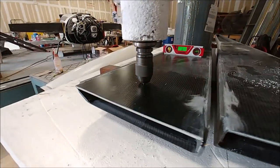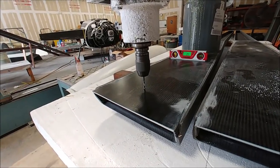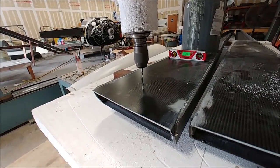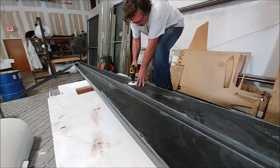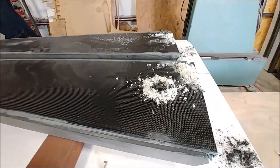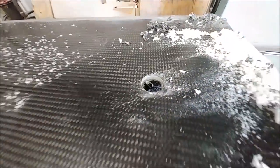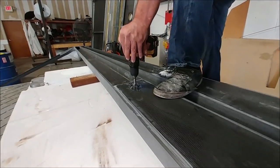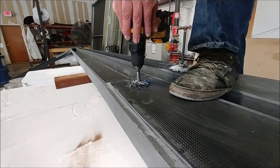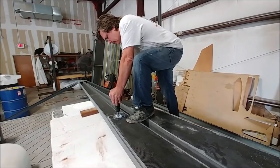You can see I'm doing the other one and it's already all the way through there. This way just guarantees that the holes are going to line up nicely and not be skewed on any sort of angle by accident. Here Jeff's using a drill bit that has a 9/16th inch hole on it, but it goes through with a pilot driver so it starts out with the pilot hole and then cuts a nice hole. He did both spars, then flipped them over and did the pilot holes from the other side as well, so those are all drilled now.